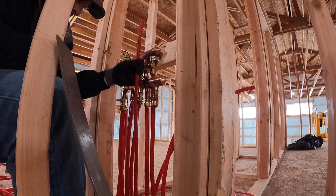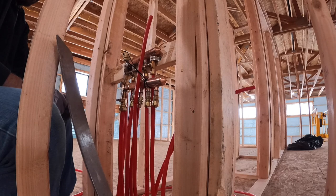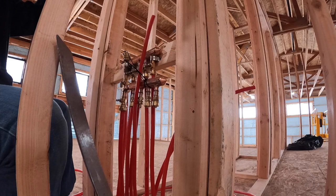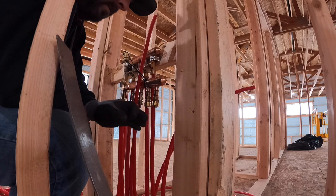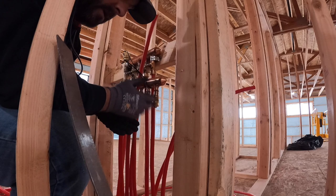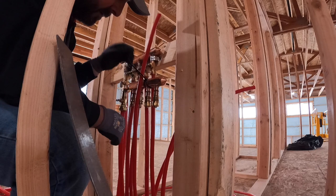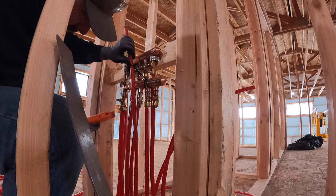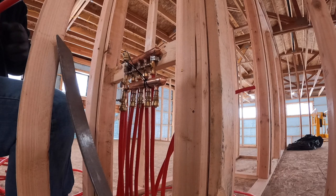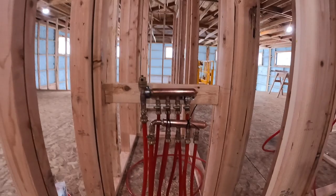And now this is the final upstairs. It requires a few more pumps. Ultimately it would probably still require pumps. I was going to say it might not, you could just do it through valving, but these larger areas need their own supplies, and the amount of liquid you have to move to facilitate these supply lines will probably require their own pump and valve system anyways. But as long as you work with your system designer, it wasn't hard for them to add these at all. That's how you do that.